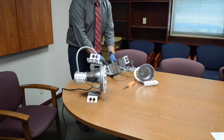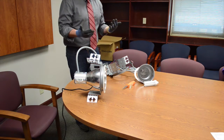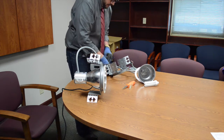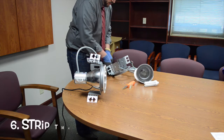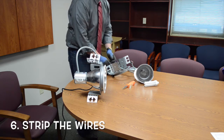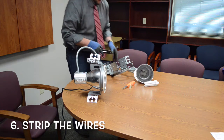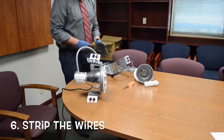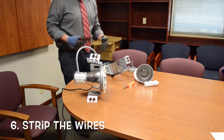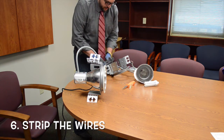Now you have two sets of wires normally within these fixtures. They'll either be blue or red, blue or yellow — a combination of two sets. You just want to identify the two sets, and it's pretty simple. You'll take your neutral, which is your white wire in most cases. Sometimes in older buildings they don't re-identify, so you deal with those situations. It'll strip any wire — it doesn't matter what color. Whatever color code you go with, keep that consistent. If you want your red to go to your white, make that your consistent move.